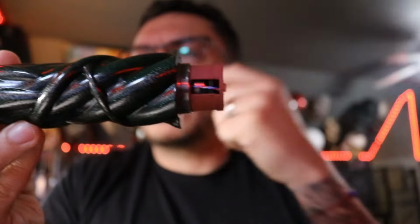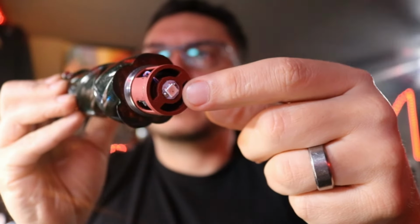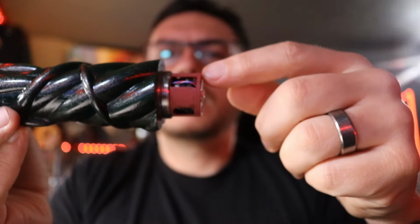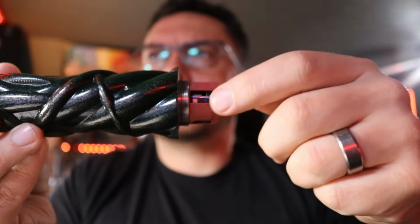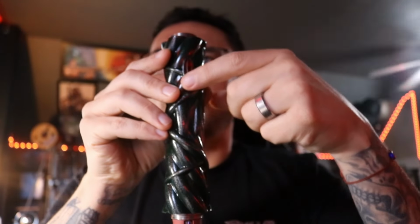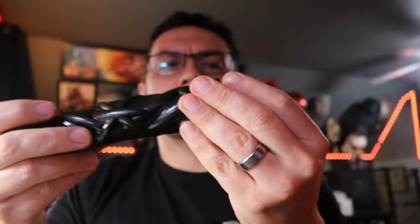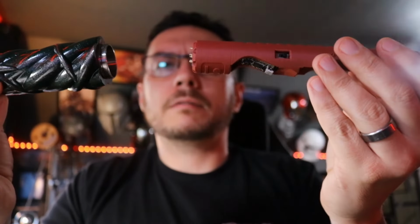Very carefully, before you push it out, you've got a cutout right here where I've got the wiring for this Neopixel accent running straight to the board. You can see it here, but that cutout in your chassis, you want to make sure that is lined up perfectly with your switch before you put your finger in the emitter side and push it out a little bit. If you don't line it up, it won't pop out properly, but it does take a little bit of a push to get it out, just like that.